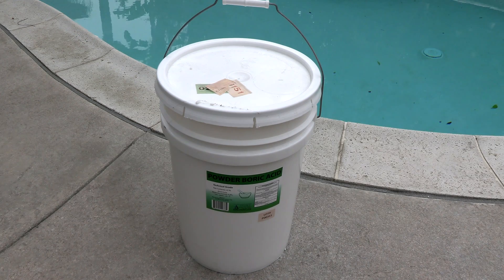In this video I'm going to show you how to add boric acid powder to the pools on your pool route to bring the boric level to 50 parts per million. I prefer using the powdered boric acid because it doesn't affect the pool's pH, and it's also very easy to add to the pool — you simply broadcast it into the deep end with the pool running.